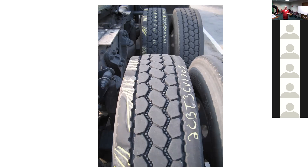From 1998 until 2007 we didn't have this wear problem. So what changed in 2007? It was the introduction of the Bridgestone 726 EL tire, which was the first step toward a low rolling resistance tire. As all the other brands started introducing low rolling resistance, fuel-efficient tires, this pattern started manifesting everywhere. It's a compatibility problem between a fuel-efficient tire and a lightweight axle.